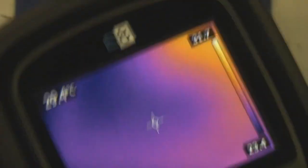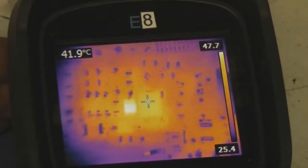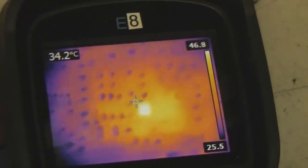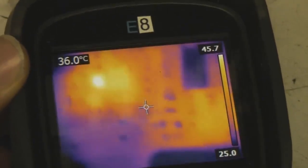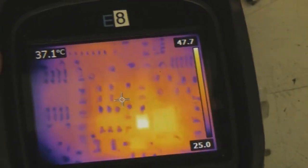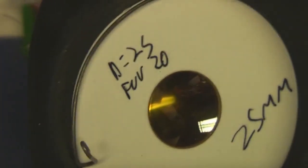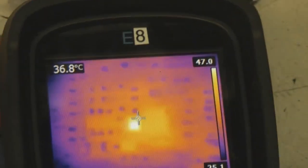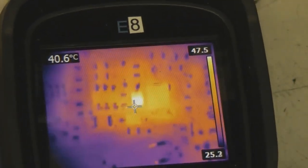This is a 25mm lens and although it does work close up, it's actually almost too close — the working distance is about 20mm. So unless you're wanting to get down to very fine detail... you can see there's an inductor there. All the component leads look quite dark because they're silver in colour due to the solder, so they have very low emissivity and appear darker even though they're at a similar temperature. At this close distance you don't get the benefit of the MSX facility because the camera offset is too high and the lens covers in front of it. But on most boards those silver bits are actually quite good for helping you locate where you are on the board.